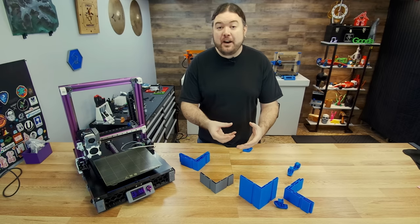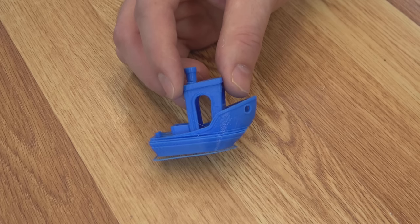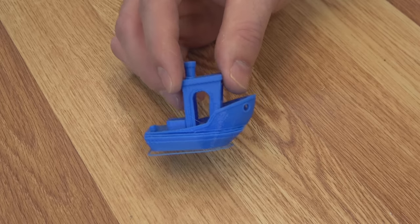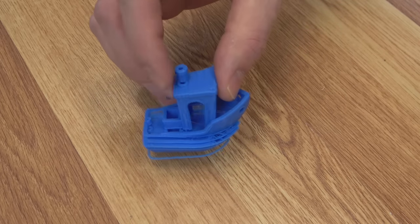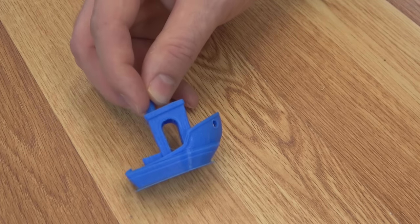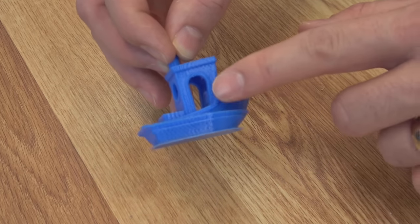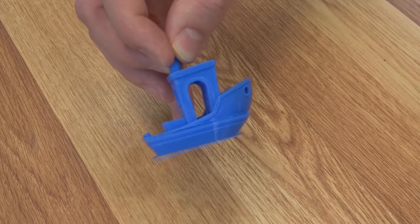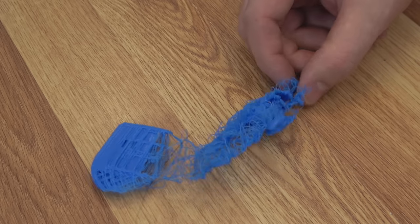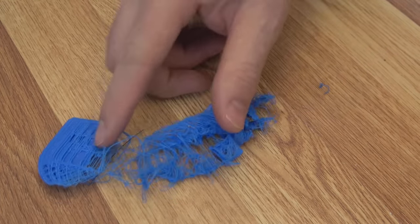Just to give you an idea of the lengths that your machine is going to go through during this calibration phase. When you're setting up Input Shaper and doing your initial tests, you're taking your accelerations to limits where you usually wouldn't. You might see some layer shift, like with this Benchy right here — it was just a couple, but it did manage to complete the print. You can see all the ringing on here. Or if you're not watching your printer closely enough while tuning Input Shaper, it might take it just a little bit too far — lots of layer shifts, pretty much all spaghetti.